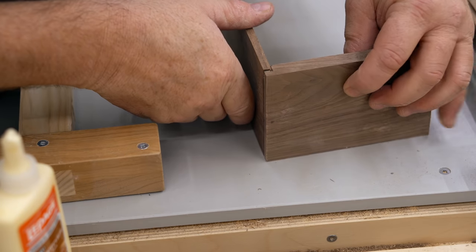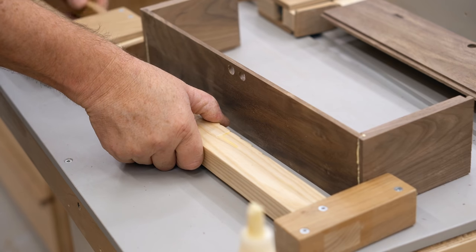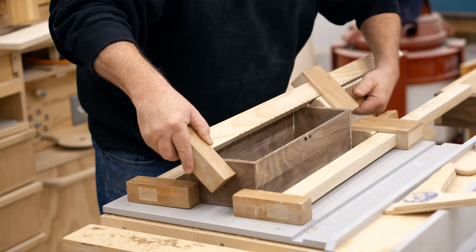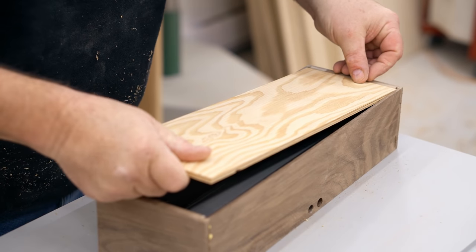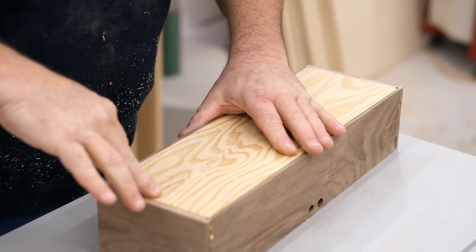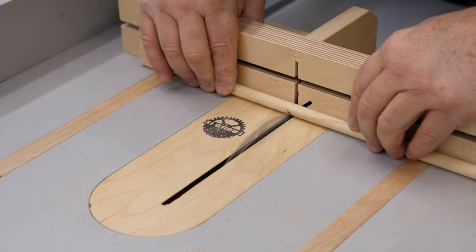Because I made those fancy tongue-and-groove rabbet joints, I only need three clamps to hold it together. I'm using quarter-inch plywood for the back panel of the box. These are meant to be mounted on the wall or on the side of a cabinet, so the back really doesn't matter much. But if you want it to look better, you can use better plywood here or veneer the whole thing on the back.